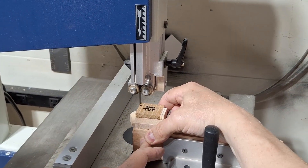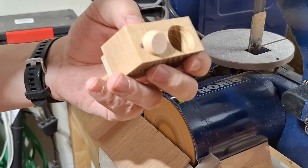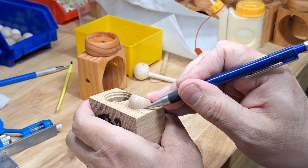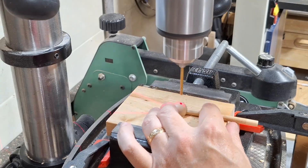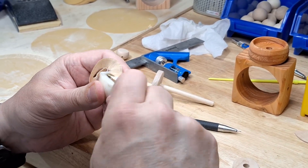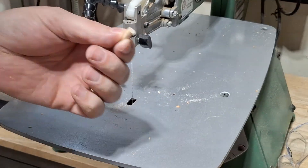I'm cutting a small slot in the larger wood ball opposite the flat side for the tail to go in. I use the exact same process for the smaller wood ball that will be the head, and I check every so often to make sure that the flat spots are about the same size. On my jig I have a couple of lines to tell me where to mark for the eyes to go on the head. The eyes are drilled out with a one eighth inch drill bit about one eighth inch deep. I used a pencil sharpener to make the bird's beak, but I found that shorter beaks look better, so in the latest versions I use a drill and belt sander to make them instead. I cut the sharpened dowel and leave about a quarter inch of length behind the sharpened part so I can glue it into the head.